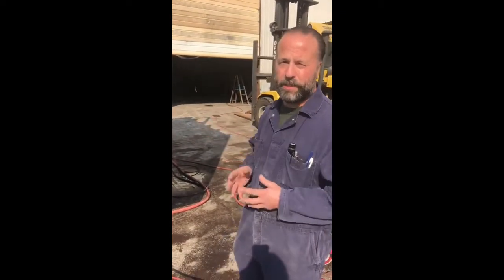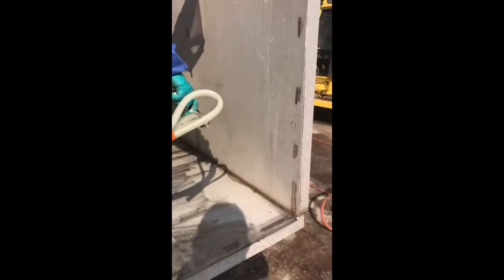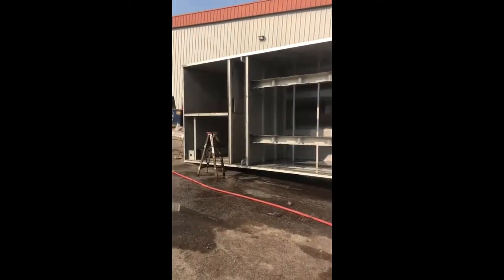In this case, we are going to be coating the entire tank. He's showing how quickly it works — if you're just doing the welded areas rather than the whole tank, this shows how quick and fast it is. This is the spray method versus the brush-on method. We prefer to leave it on at least overnight. In this instance, because it's the weekend, we can safely leave it on throughout the weekend and come back after the weekend to wash off the product, using pressure washers to clean the surface. This entire tank will be pickled and passivated. He's already done one inside — so we have the before and the after.